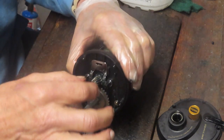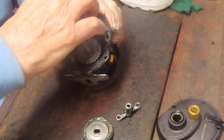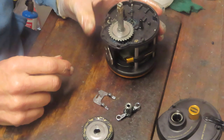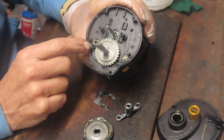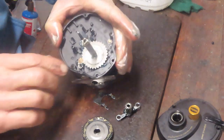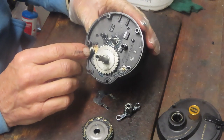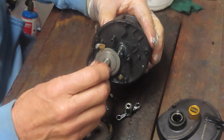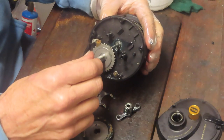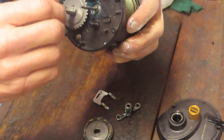We have a yoke assembly with the pinion drive gear, and we have a jack that pushes the yoke in and out. Next up we have a click ratchet and a failsafe anti-reverse. The anti-reverse clutch is going to do the most work, but this is an old-fashioned tooth dog. As you reel the main shaft it's fine, but when you go to back it up, it falls back — that's the way this works.